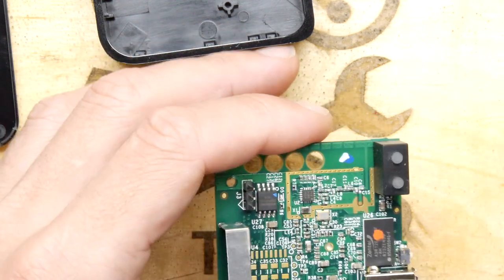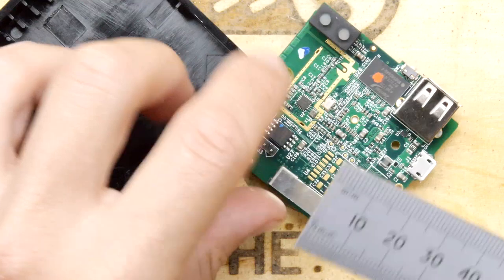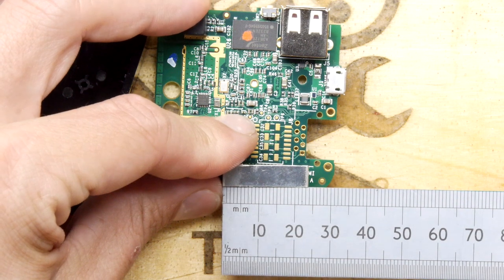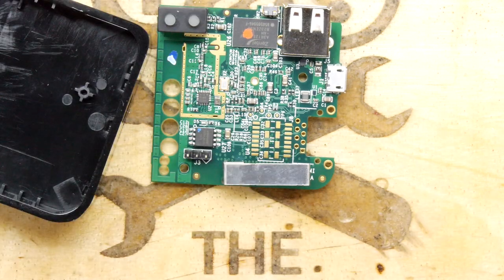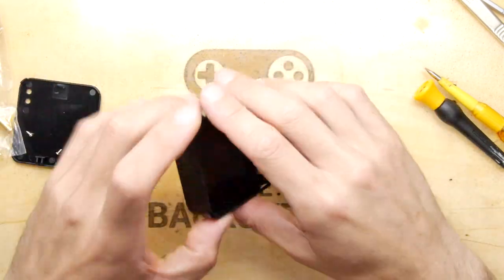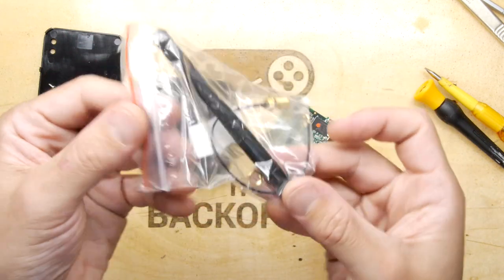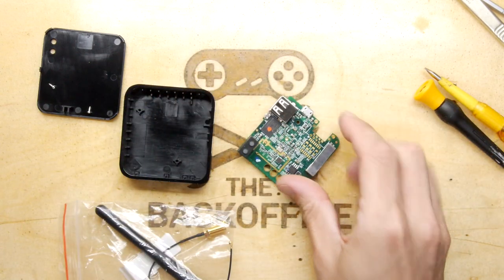I would say that's a Wi-Fi antenna. Let's measure it — if it's normally like two-point-something centimetres. Yeah, look — 2.1 to 2.4 centimetres — that's like 2.4 gigahertz isn't it? I don't really know the maths but I used to have antenna calculator software when I was at Loughborough University. I remember making Wi-Fi antennas and they always had a bit cut off about that long. So let's go with that.